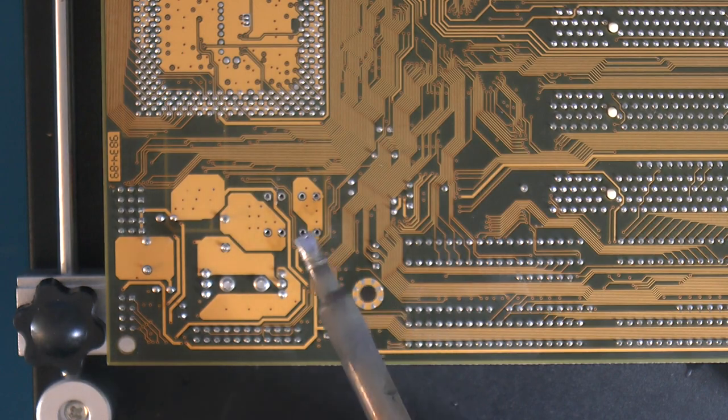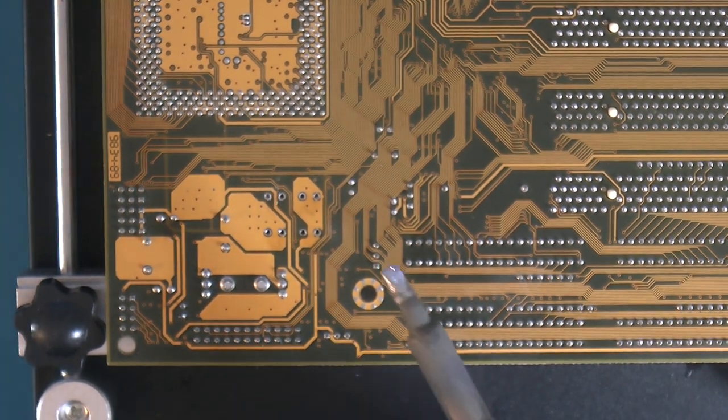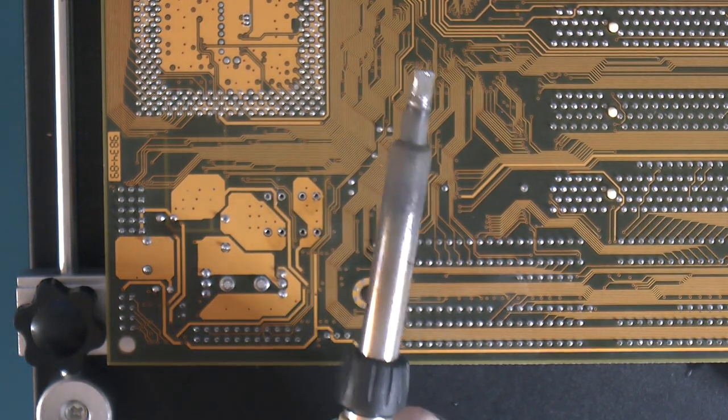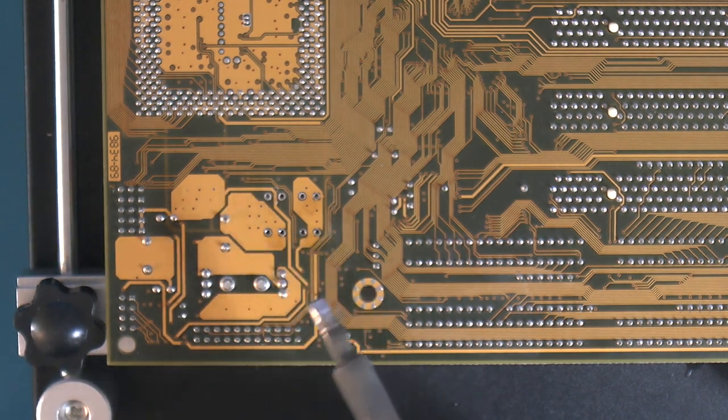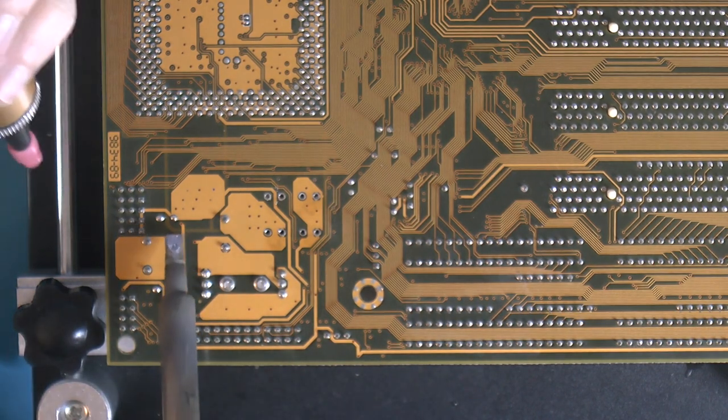You can see here, I would recommend if you want to do soldering, fixing your board and graphics card, to get like a 5mm tip. This is 4.8, I think I can buy 5.6 too. But 4.8 is still fine, because the radial mount is 5mm, so it's enough.